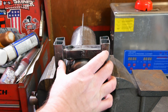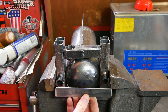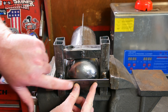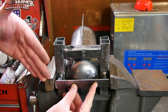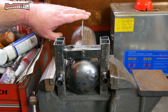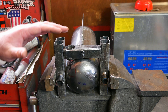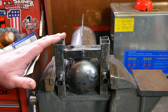In addition to how it's positioning the cylinder, I've also got two pegs on the front that act as stops — I can put a piece of flat steel across there and bump the end of each tank right up against it, which helps keep them in the same position. Then I go over this and make sure it's level, make sure this is level as well, and check everything out — basically tightening and loosening the vise repeatedly until I get it set up the way I want it.